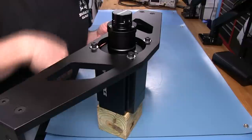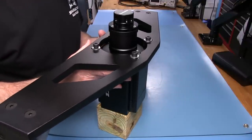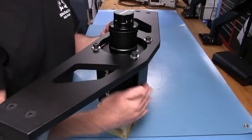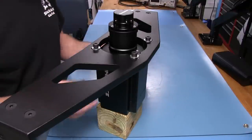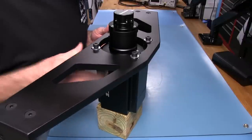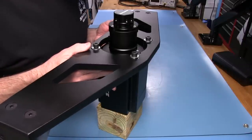Make sure everything's getting loose here as I'm sliding these around. And you've got to be careful again. I don't want to scratch up the flange on the motor, if at all possible. And I'm also looking down at the flat of the motor and making sure that these pieces up here and here, depending on your angle, look flat also, because I don't want it twisted. But if you line these grooves up, or these slots up, and the spacing on them, it should be centered.